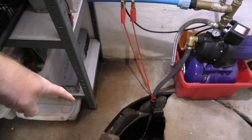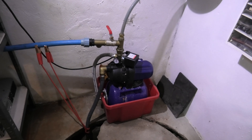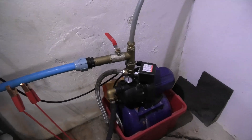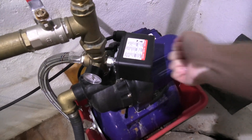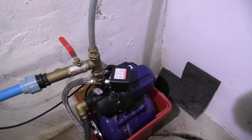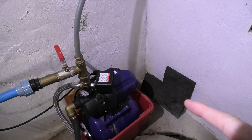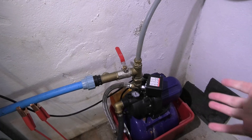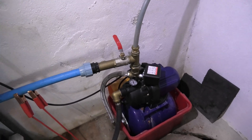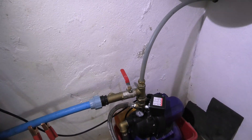The booster pump is pumping up water from this well. There's sand in the bottom of the well, so small fine sand particles find their way up into the booster pump. I'll just temporarily fix this — the fix is to knock this box. There's a little thing inside that turns the pump on and off. There's water going out this way so we'll shut that off. It's not enough water to start the pump all the time, but it's enough to keep the well down while I'm using my washing machine.